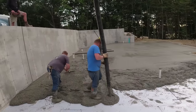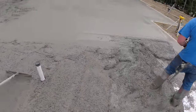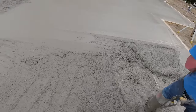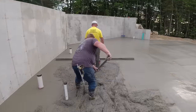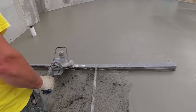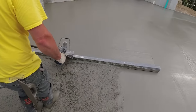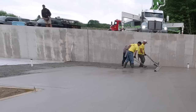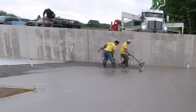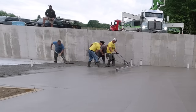And remember, that second truck, there's still the whole hopper full in the drum of that second truck, and then all this pipe, including all the boom, is still concrete from the second truck, because he can't just pump that out to nothing. He can't just pump air out of there and push concrete out. He needs new concrete in the hopper to push out old concrete that's in the hose. You see that third truck's up and back there now. He's kind of mixing. And we're just getting towards the end of the second truck.